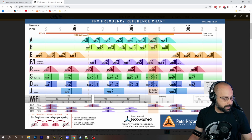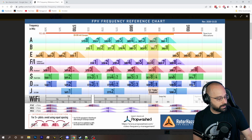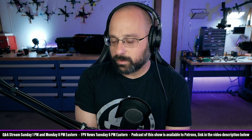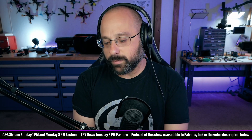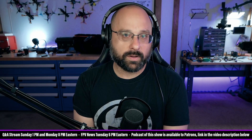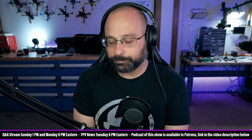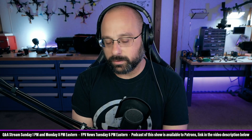The next thing you can do is turn your output power down. If DJI is blasting 1,200 milliwatts, it can cause interference even if you're managing your channels correctly. If you're flying with two or three other people who know you really well and have a good established rapport, you could say, 'Guys, I'm going to go up to 1,200 — tell me if you have any problems.' But if you're flying with a larger group and you want to be maximally polite, turn your goggles down to 500 or 200 milliwatts.